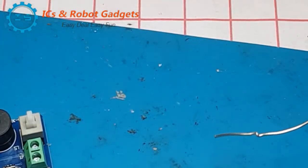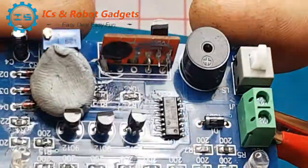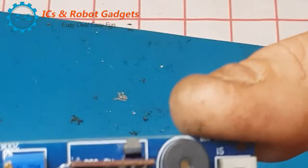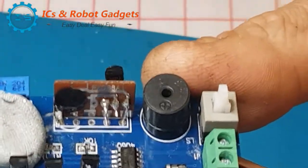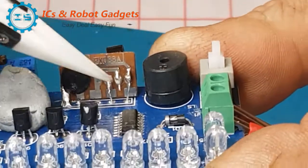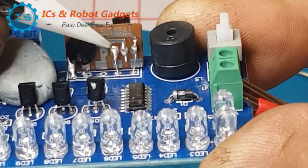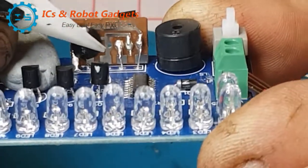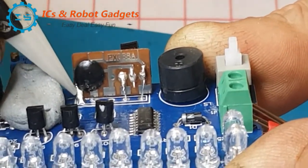So hang on. So I'm going to try and get you a close-up on that. I'm going to raise this light up to light the board up a bit more. So as best as I can get it. As you can see, let me get my tweezers. There we go, that's in picture. As you can see, the first and second hole, which is the first and third pin of the transistor, have been soldered in. Then the next two pins are not connected, and the very end pin next to the chip on board,